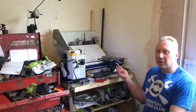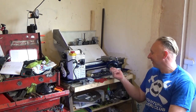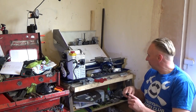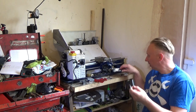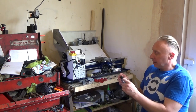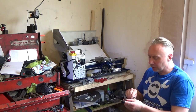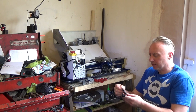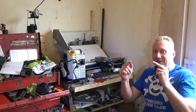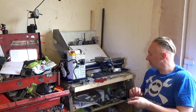Hi, right, I battled and I won. It was intense. Oh, yeah, I've got a bit of shim left over here, which obviously I forgot to pack away. The shim was part of the feeler gauge set, and it had two 17 thou shims either side. And there we go, in the centre it had a 9 thou shim. So clearly it's banana shape now.